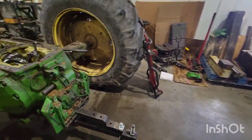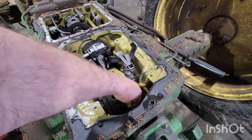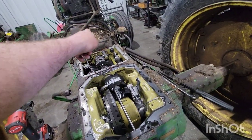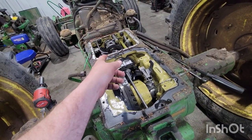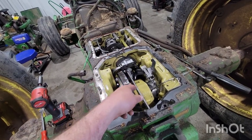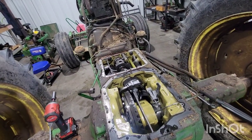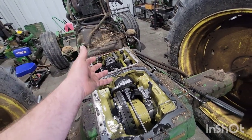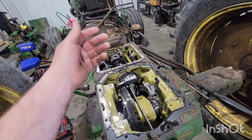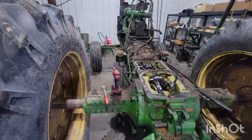The next thing to do is pop this off — there's a cap behind here that the hex shaft rides in. This hex shaft locks into the end of the crankshaft and that's what drives your pump. That's why on the 30 series you can hold the clutch in and not lose your prime. But on the 20 series, the pump is driven off the top shaft, so when you push the clutch in on a 10 or 20 series synchro transmission, your loader will eventually stop working. You've got to click to neutral, let the clutch out, and everything comes back.